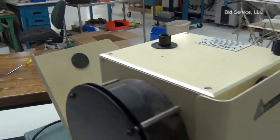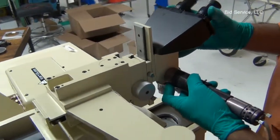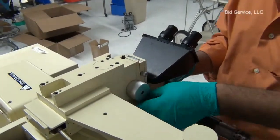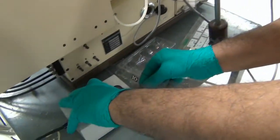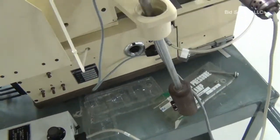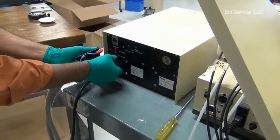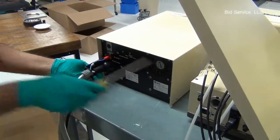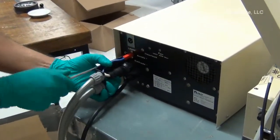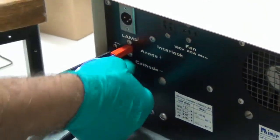I am going to install the microscope now. First loosen the holding screws, slide in the microscope all the way down, and tighten the screws so that it is clamped. This is the microscope illuminator power connected to the power supply. Connect the big black connector first, then the red one. The bracket assembly clamp should be clamped to the lamp housing screw — there is only one screw here — and this will hold the electrodes from straining.